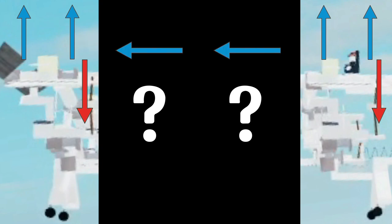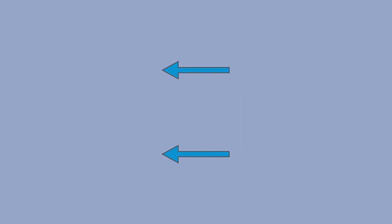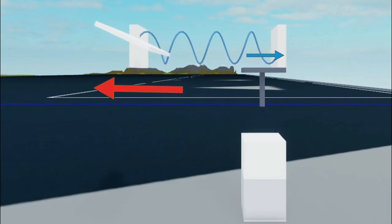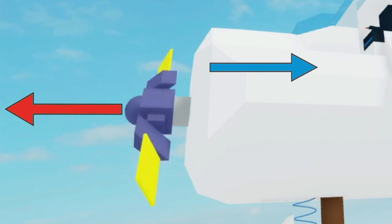The wings already move downwards to produce lifting force. But what about the force to make the plane move forward? In order to make a forward force, if an angled wing is moving linearly or rotationally depending on the axis, that wing will move the air backwards, resulting in a forward force — just like how propellers work. The same will happen in the mechanical wing we made. When the wing goes upwards, the wing will rotate to a limited angle of around 45 degrees downwards, which results in the wing pushing the air backwards, therefore making the plane go forward.